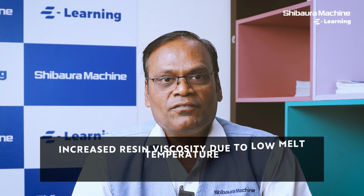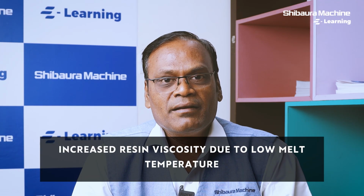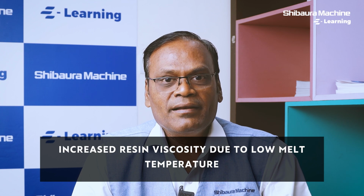Another reason for short molding is melt temperature of polymer. Selecting the right barrel temperature, considering the polymer guidelines, is very important. If the material is high viscous and melt temperature is too low, a short molding can occur easily.